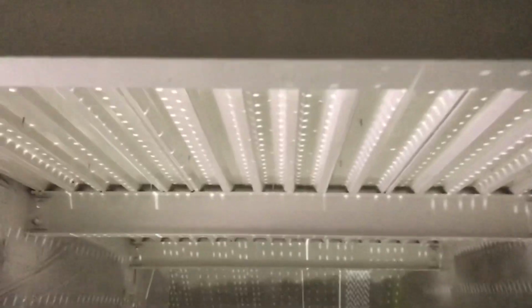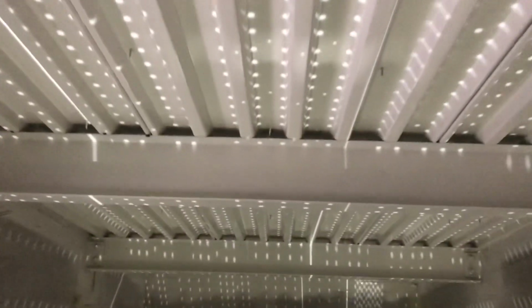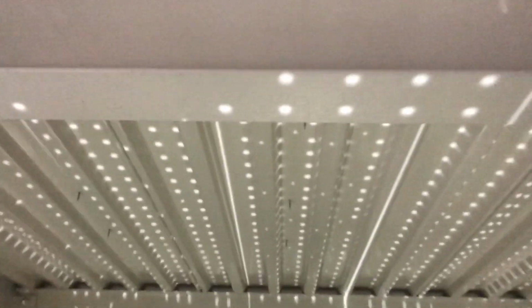Now that we've applied the coat to the Q deck, nice and even coat, going in both directions, once from this side, once from this side. We're going to be spraying on the second coat in the exact same order. So I-beams first, then Q decks after.